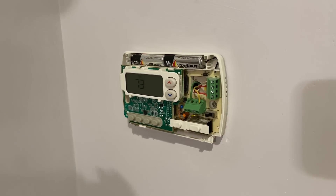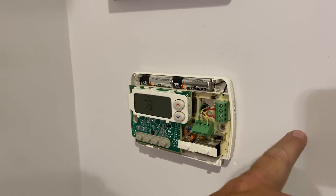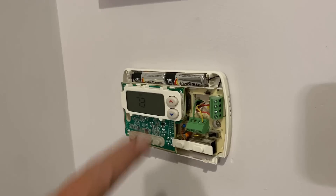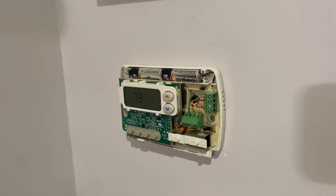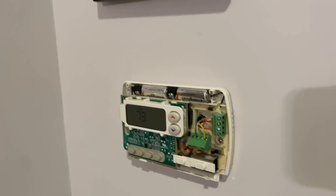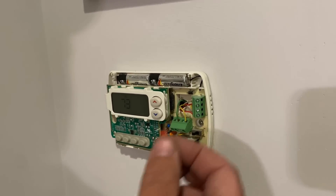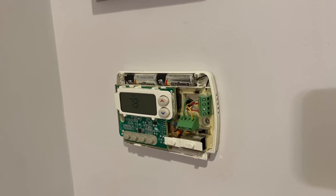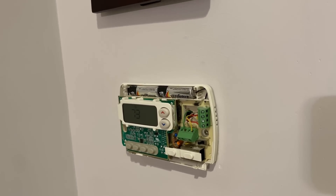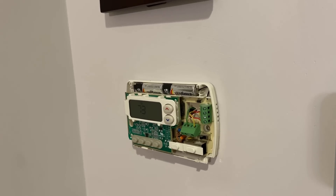This jumper was between RC and RH. RC has 24 volts — that's the R terminal at your equipment. RH technically doesn't have power, but it may on newer Taco switching relays — like the one on our training board — which has an R, W, and C terminal on each individual zone to allow use of Wi-Fi thermostats. So could there be power at RH? There may or may not be, but if I touch those two together, nothing good probably happens. I'm going to touch those two together; you go downstairs and tell me if that zone turns on.